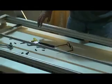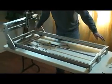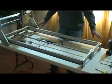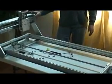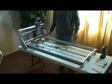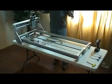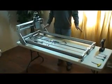But put a square inside of this X to make sure you're good and square. If you have to leave the nuts a little loose just while you're screwing that top down, go ahead. You want this to be as square as you can possibly get. But if you get off a little bit, on two screws over here, you can loosen it. There's an adjustment that you can slide this back and forth. After you cut a piece, you put a square to it, and if it's not dead on, you've got some adjustment here. Because a lot of people will bolt these down to tables, and the table's not quite square, level. There's a lot of things that come into play. But this is set up to where you've got some compensation here that you can make it work.